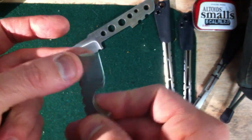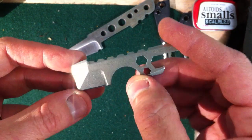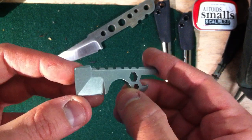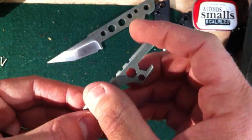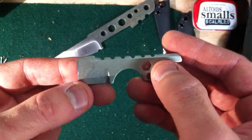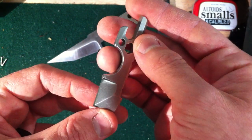These are V grounds, or the double ground. They were heat treated by BOS Heat Treat, and then I actually sent them somewhere else to get them stonewashed professionally. The flats I left with a raw finish. I had hand stamped them, and then anything that's ground was taken to a polish and then stonewashed.